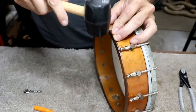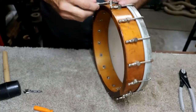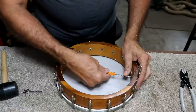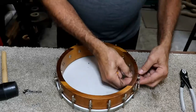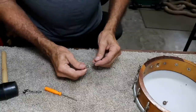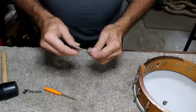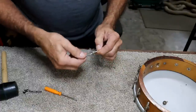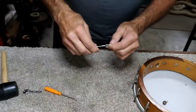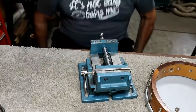I put a little shim from the neck right there and pulled down on the hook by hand to straighten it. That helped some. I also tightened up the screw on the inside to help hold it better. I'm pretty good at tapping things straight — been doing it a long time. That's pretty straight, almost perfectly straight. But that only solves the straightness problem. Now I've got to think about using heat to get it apart because it's stuck like it's been cemented — someone may have used Loctite on it.